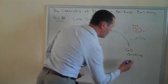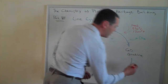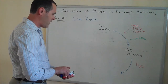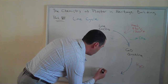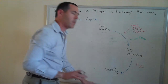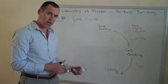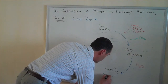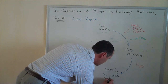Typically, the processing continues to arrive in a much safer place. At this point, what gets added is water. The resulting reaction takes place between the very reactive quicklime and water to form calcium hydroxide. They put just enough water in the form of steam to quench the quicklime — just enough for a complete reaction and not an excess amount of water — so what you get is a dry hydrate, or slaked lime as it's called.